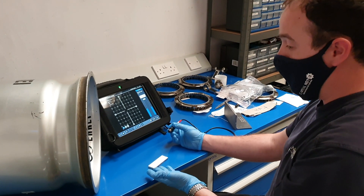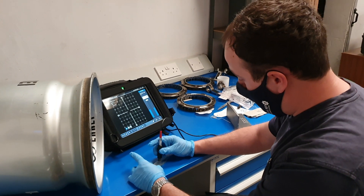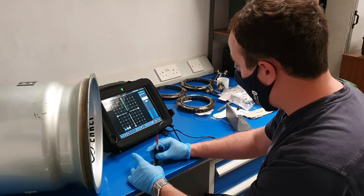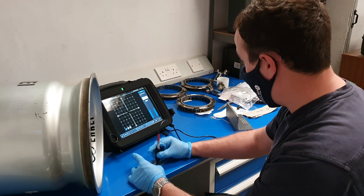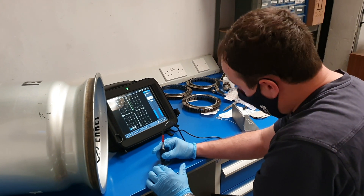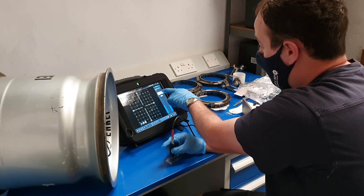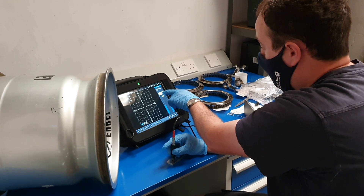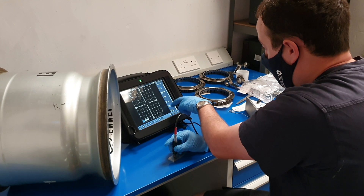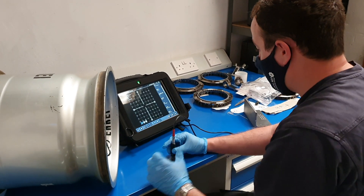What I've got here is an aluminium calibration block, which I'll use to calibrate a one-millimetre wheel defect, so that when I'm scanning I can find anything easily up to a millimetre. And there we go — that is now calibrated.